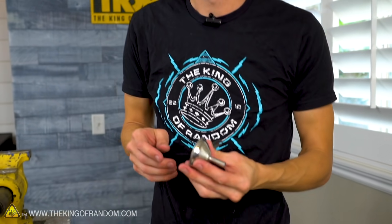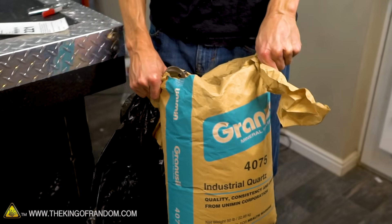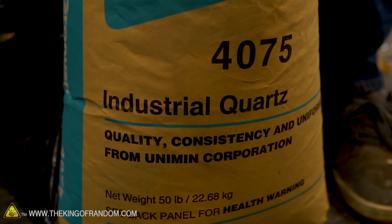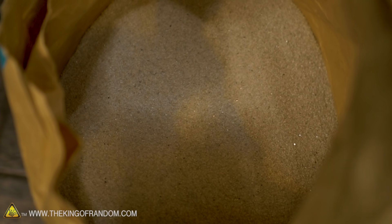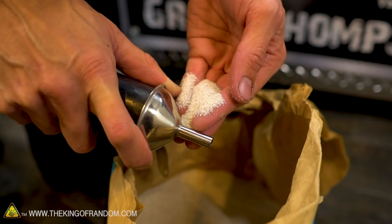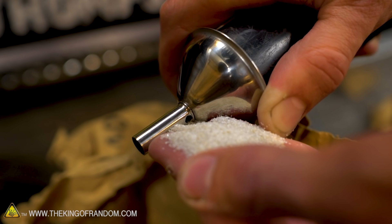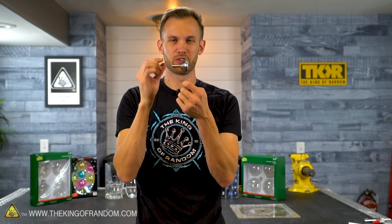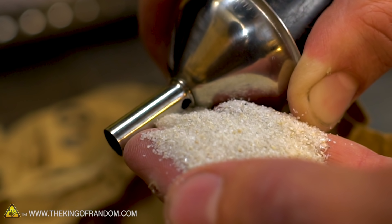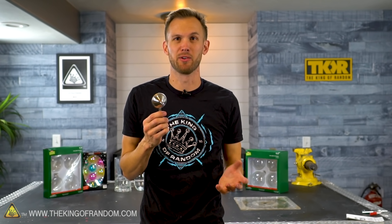Here's what we're going to do as a little test: we're going to fit the funnel over the hose of the vacuum, and then just put some sand next to it and see if that sand gets pulled in. This sand is the exact same stuff I used last time — it's an industrial quartz, usually sold with cement. It's really great because it's a pretty uniform grain size, which is nice for sandblasting, and it seems fairly rough. I'm just going to have a little bit of sand and hold it close while the vacuum is turned on and see if it starts sucking the sand in. So we have our venturi effect — the fluid air is moving from the wider area to the smaller area, pulling in through that side hole, creating a low pressure zone right where it gets narrow, and that sucks the sand in as well. Now what we need is a way to hold all that sand in place near the opening that we drilled, so you don't have to just be feeding it in with your hand.